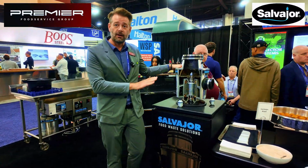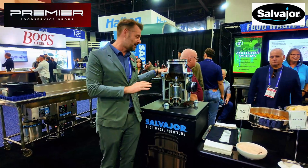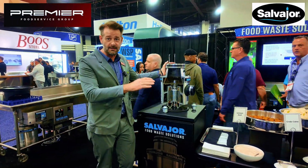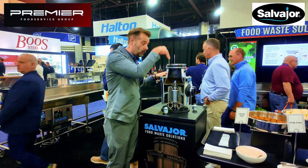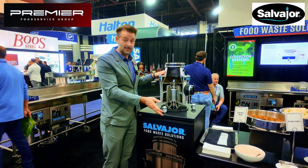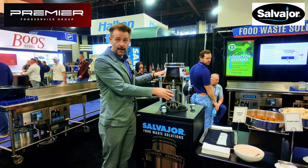Salvajor is water cooled. Everybody else in the industry is air cooled. If you've got anything other than an old Porsche 911, that engine is water cooled. Water dissipates heat much better than air does. So the water that flushes stuff down the drain is also what cools the motor, which means as long as water's flowing, this doesn't ever burn out.